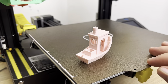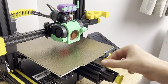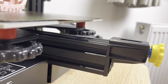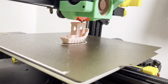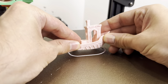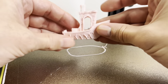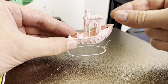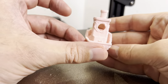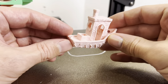Now it's time to take this print to the extreme. I've loosened this pulley even more — now this belt is mega loose, and we're going to be in for a real treat. We can see during the print this belt is just jumping around because it's so loose, and the benchy up there is not looking so good. What happened to this benchy? This thing is ugly. With a loose belt and the bed shifting around, I think what we're seeing is infill poking through the front. The rear side of the cabin is super shifted — it's like an S shape. This is the result of a really loose Y belt, so keep yours tight.